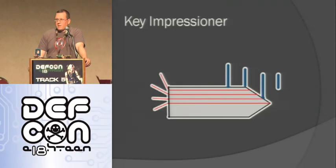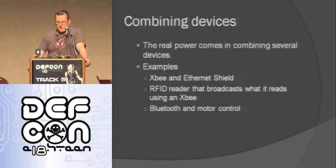They're coming out with some professional versions of this. I think this year you're going to see some coming out. But it's an interesting little project that I've just been messing around with for the last week or two. All you do is connect power to the body of the lock, and then connect all these wires coming off the back of this to your Arduino, and see which one is giving a high signal in a digital read. That's the one that's hitting, because the body is giving power, and it goes through the body of the lock, through the tumblers, and into the device.